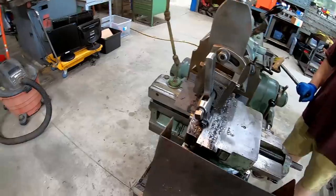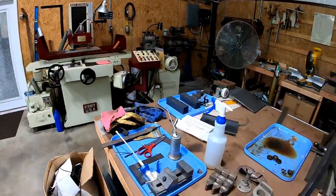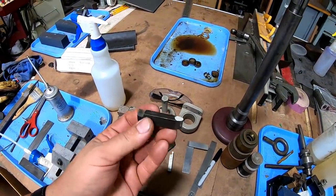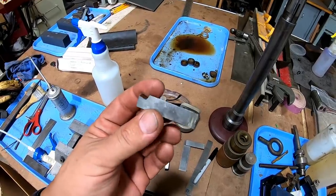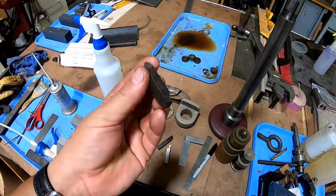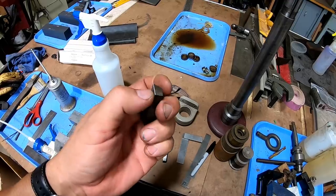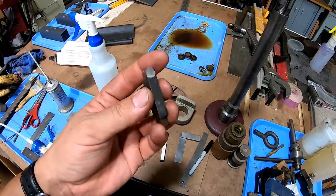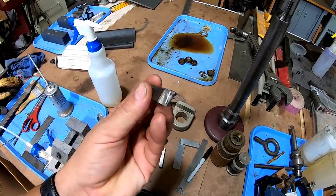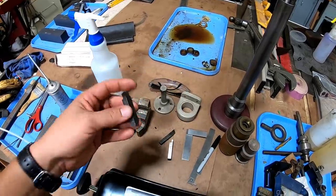So we're having some fun with that, and he's still got his stones going over there, but I've been taking a couple of tool bits that we had, which is 3/8 by half, and I've been grinding up a couple more tool bits that he'll have on hand that he can use. There's another, I left this one a little bit more sharp with less radius so that he can modify that if he needs. This is around those in there, ground that up, more of like a shovel nose, so he can use that if he's got some rough casting to shape in.